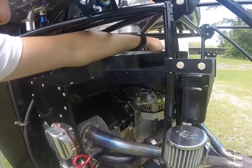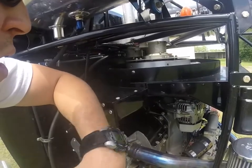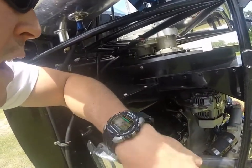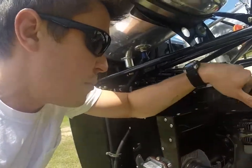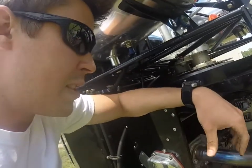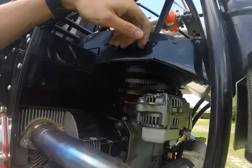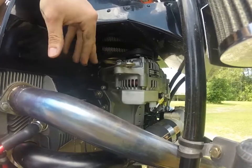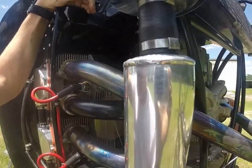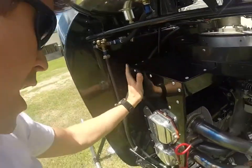We will go ahead and check the clutch. You always want to make sure that the clutch is loose before you take off — it will prevent stress on the engine if there is more friction than usual. If there is excessive friction, two things you can do: you can put some 100 low lead in between the crack right here and break it free, or you can also put a little bit of engine oil in there and move it back and forth to break it free. Moving down to the engine, we have our alternator belt — the only belt on the helicopter, which is nice. Make sure it is not overly tight and that you can't twist it more than 180 degrees. We are also checking our shrouds and spark plugs — I will run my hands over all areas with screws to make sure they are not loose.